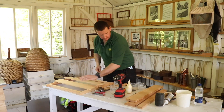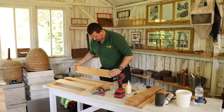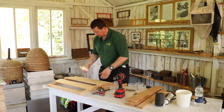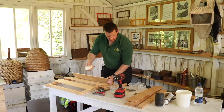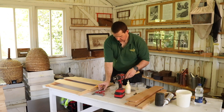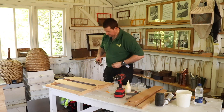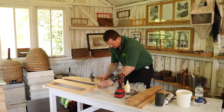The next one on this side is the one that's square on both sides. It's worth putting just a little bit of glue on the join as well, just to prevent them from spreading too much, and then just agitate it a little bit so that the glue adheres to the other timber. You've already got the position of that one so you can just line it up, follow the lines that you've started with down and then carry on. When you do this second one, it's worth using your hands almost as a cramp and just squeezing it together.